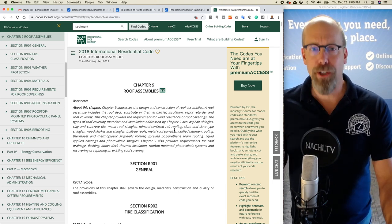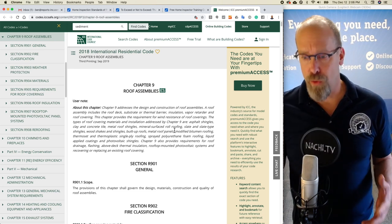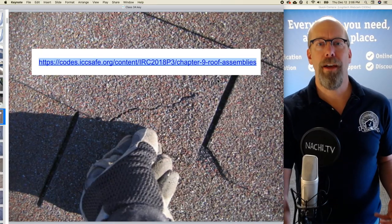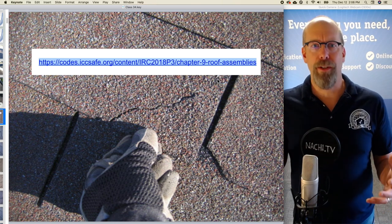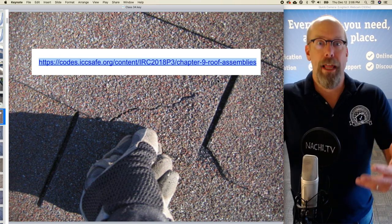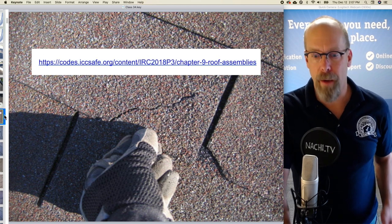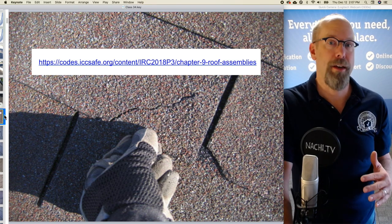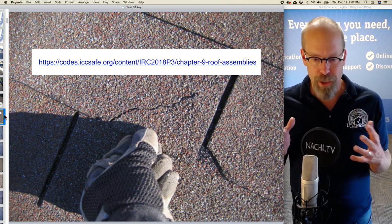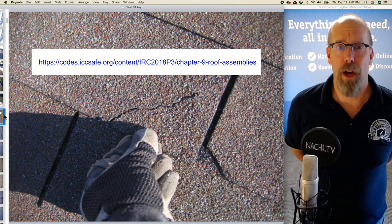You are actually observing the roof covering materials. You're not actually inspecting the roof assembly or the roof system, because you can't see everything that is assembled together, all the components. You can't see, for example, the fasteners or the underlayment, right? Or the roof deck. So only observe and comment upon what you see. So a home inspection is a visual only inspection. So it's essentially like getting both hands, tie them behind your back, and perform a visual only inspection.